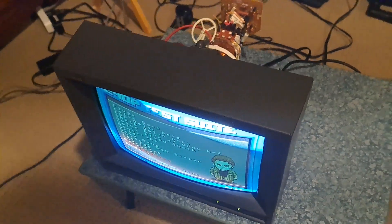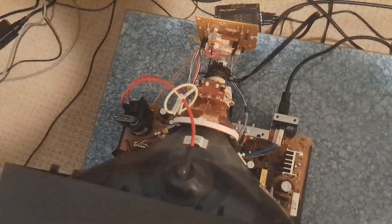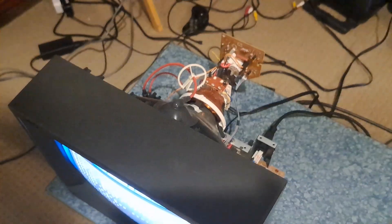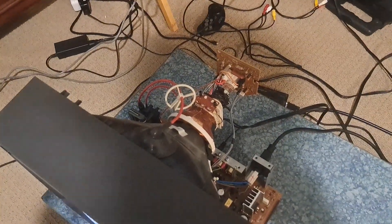What I had done just now was take the whole backplate off — as you can see, it's laying right here. I went to go adjust the convergence rings, and while I was at it, I was also going to adjust focus too, just to make sure everything was good.